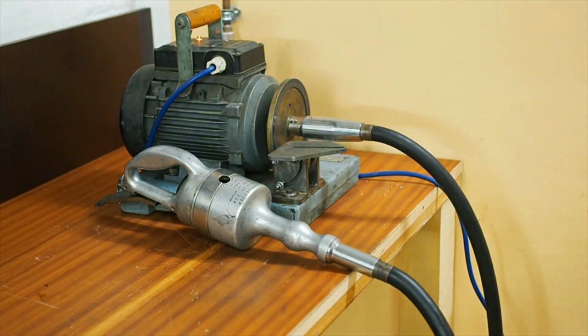The advantages, it's much quieter. It's got the nice built-in hone, so it's easy to just quickly give a hone in between scraping passes. The downside, it's not very portable. The whole thing together is pretty big and heavy, and it doesn't have any adjustable speed unless you put a VFD on the main motor to slow it down.